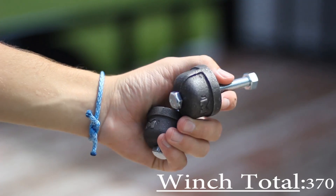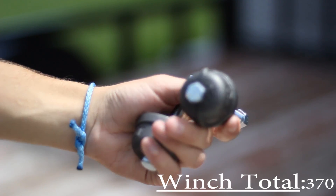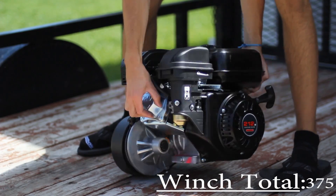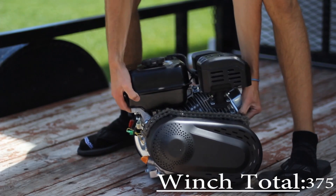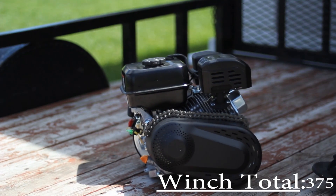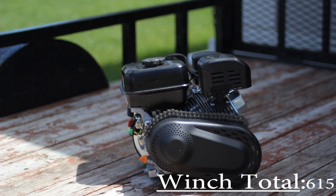Black steel caps serve as great legs for the winch — just weld them on there, it'll be about $5. This is a 6.5 horsepower Honda clone — it's a Predator engine. Here's our TAV, our torque converter, and this is a chain. Together it'll run you about $240 to get the drive done.